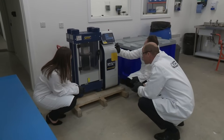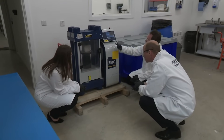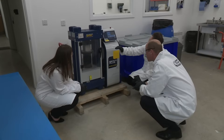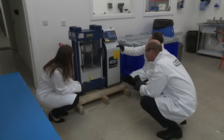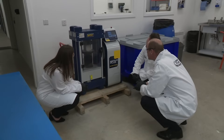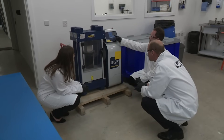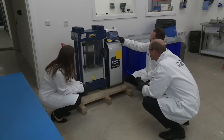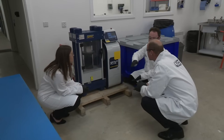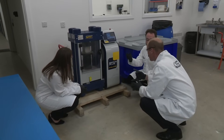The gap between the top plate and the key will start to get smaller. What we'll notice on the screen is as the top of the key touches that top plate, it will start to register a force. We'll see here a change of sound, and you can see a red line that starts to go up — that's just applying more and more force on it. Once it reaches the target, it will end.